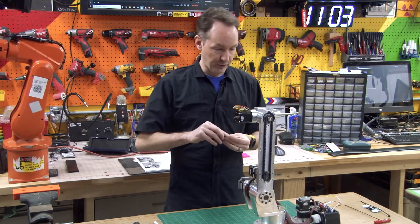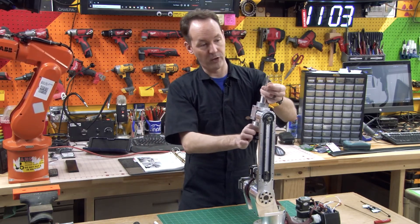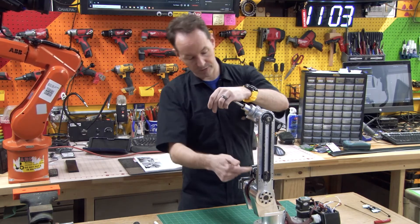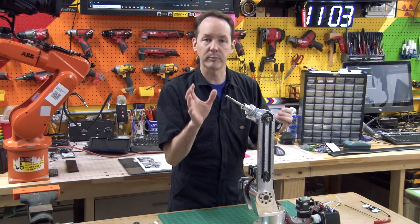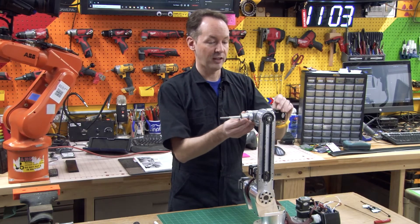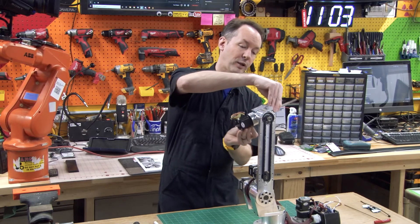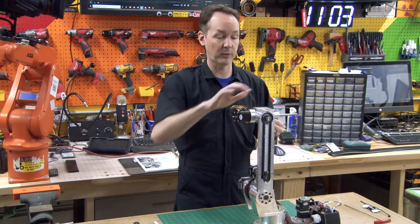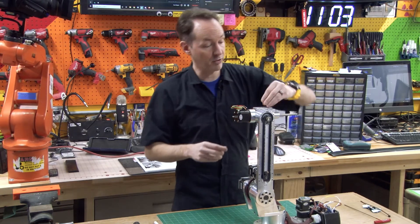You'll notice that I have this upside down — it will flip all the way around. You want to move it slow because there's a gear drive there, and if you just whip this around you're going to spin the motor. Just don't do that — be gentle, be slow. Normally this is sitting like this and I'm just inverting it entirely around this way. You won't be able to go the other way; if you try to go forward you're going to trip the limit switch. That's the bar we installed. Now I have half a dozen washers in my stack, which is a lot.